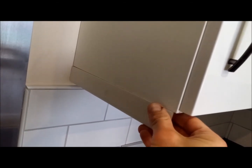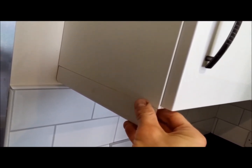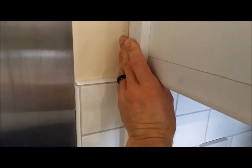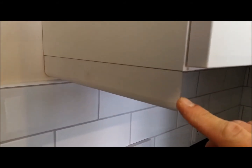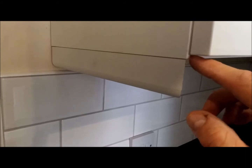The next step is to offer it up and mark the position of the holes on the brackets in the cupboard, and then we can screw that up. It's a bit more useful if you've got someone else to help. Put a piece of wood up against the edge of the cupboard and use your thumb and fingers to clamp the pelmet up against the edge to ensure that when you mark it, the front edge will be as flush as possible. Just make sure you leave this edge just slightly further back than the corner, so that when the other one touches up it's not pushed further forward than this edge. I've managed to get a very slight lip there, which I'm not overly happy with, but unfortunately that's just the way it is.